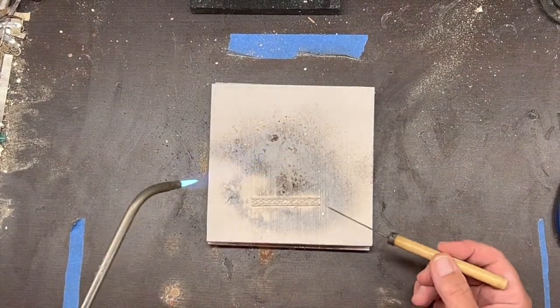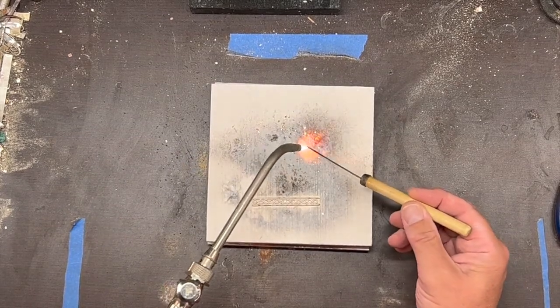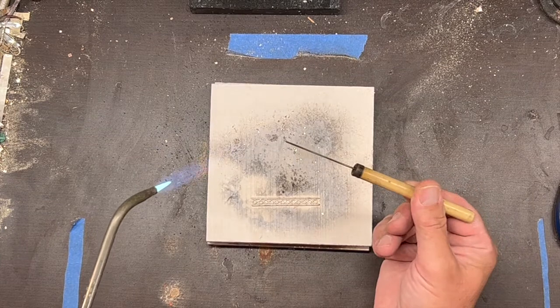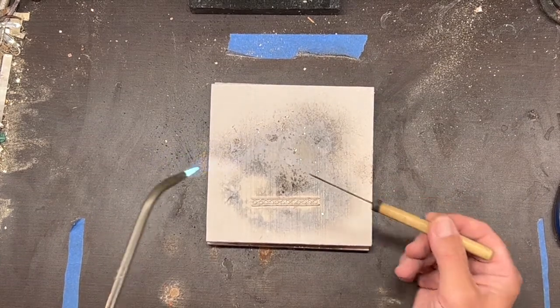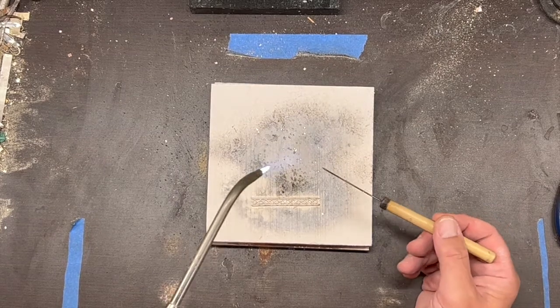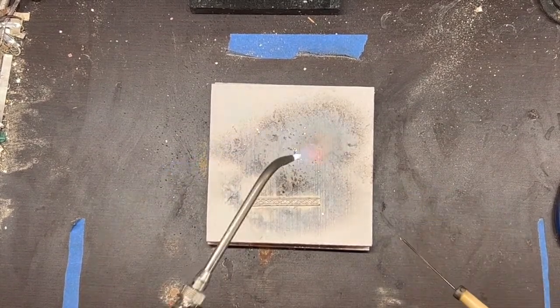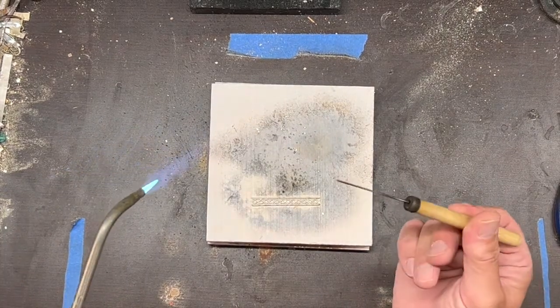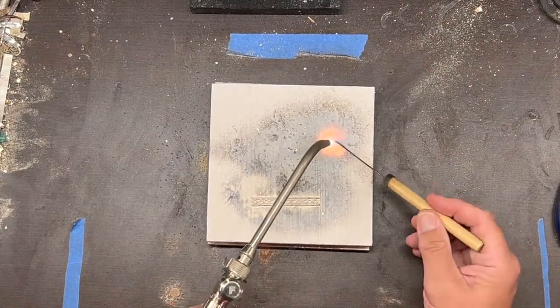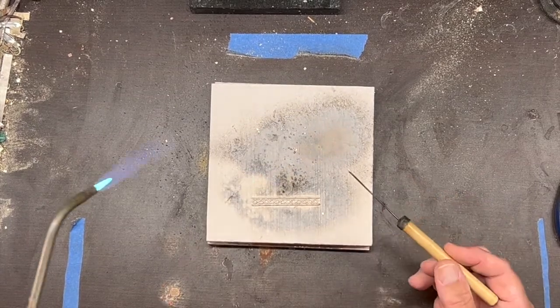and it should flow right on there. So in practice, what I do is I pick up a piece of solder like this, okay, I've got to melt it onto the tip. That's sometimes the hardest part. To do that, in order to pick one up, a lot of times what I'll do is I'll melt it, and then as it's cooling and I move the heat away, I jab the pick in there and it'll pick it up. So I actually picked up two there, so I'm going to pick one up instead again. Okay.